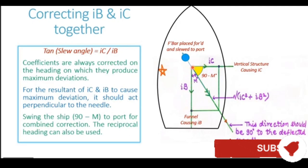Now let's also assume that on this particular ship, there is a vertical soft iron structure to starboard of the compass, and that structure is present here at this particular location. Now this structure is going to cause induced C, and this vector where the laser pointer is right now represents the component or coefficient IC. Now if we take a resultant of these two coefficients.